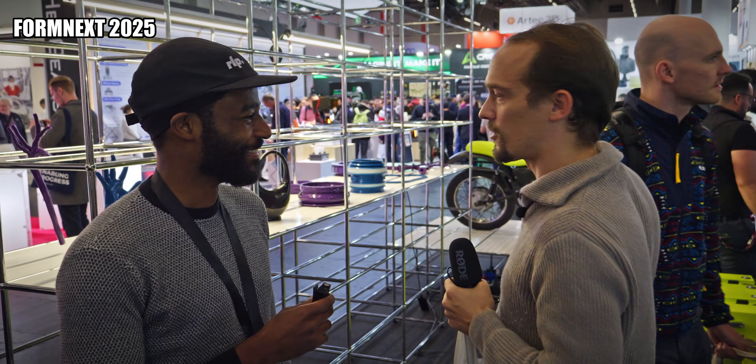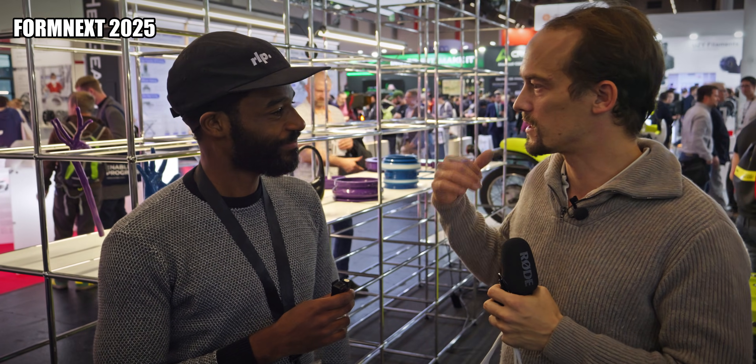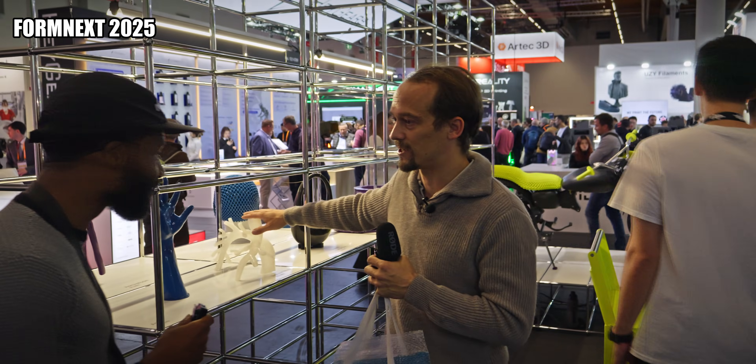So it's basically just a normal hydrogel — it always looked like hair gel. It's not hair gel; you could put it on your skin but it's probably not going to do what you want. The material is a two-part platinum cure silicone, so you need part A and part B to mix together so they can chemically react and move from a liquid to a more solid state. And because you're suspending it mid-air, you don't have to cure fast like an FDM printer — we actually want it to be uncured as long as possible so that it blends into itself and becomes isotropic.